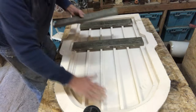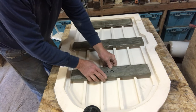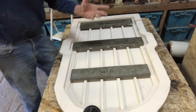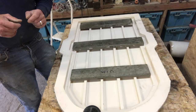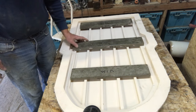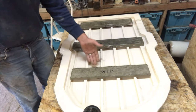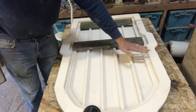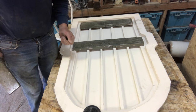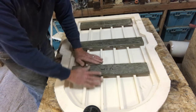In this video clip, I'm anticipating mounting the three support prototype pieces onto the mold, but first I must cast the five seat slats, since the rubber that will be poured to capture these items actually rests on the backside of the seat slats. I decided to cast the slats using a rapid-set drywall plaster, as it wouldn't bond to the existing rubber or to the support prototype pieces. Keep in mind I'll have to do this on all four molds. I'll now show the pre-casting of all the first-level components for each mold.